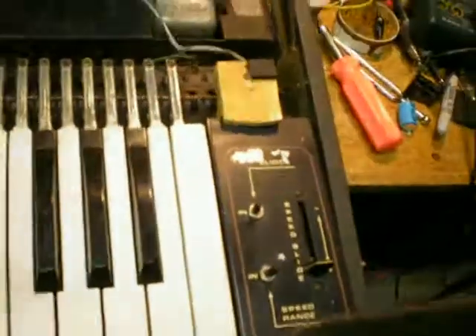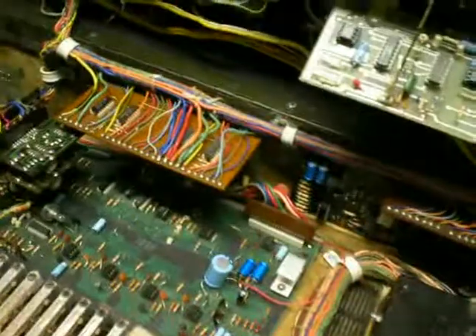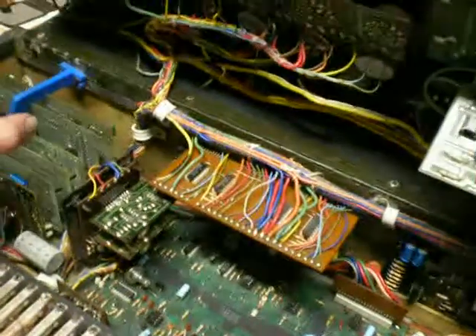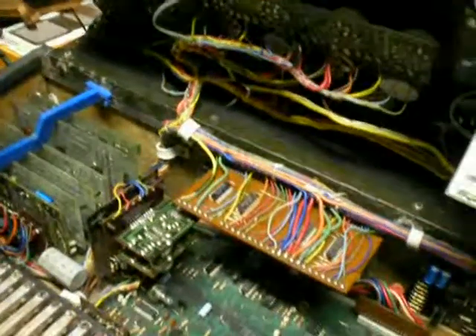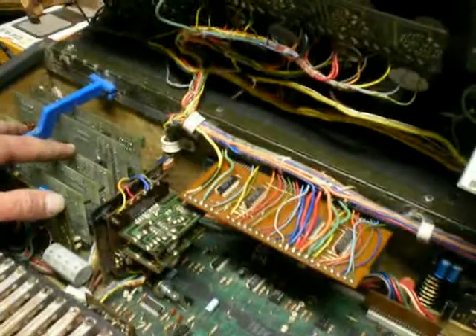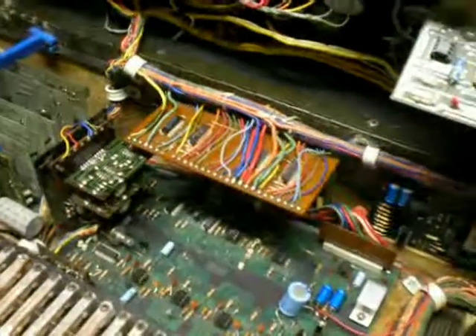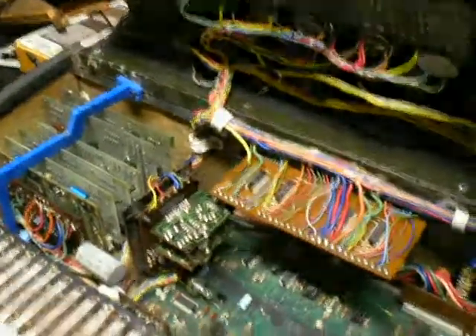On the DAC board also is the glide, and the glide and that are in common. Neither function worked because of that op-amp being bad. It just has a resistor between the digital message there, and it delays the transference of it back — loops back into the circuit. It's kind of a feedback mechanism they worked out there to do the glide. It's pretty interesting circuitry.